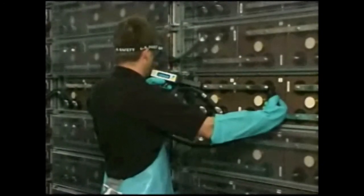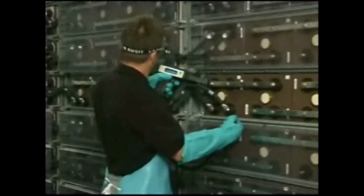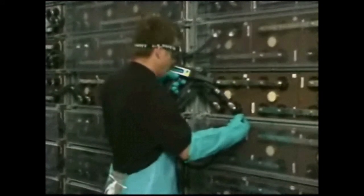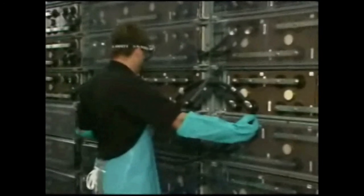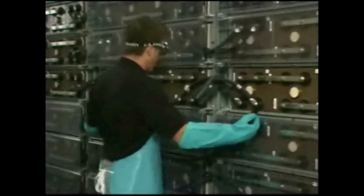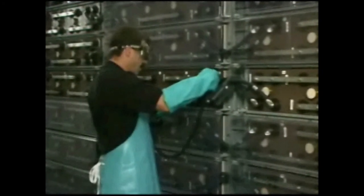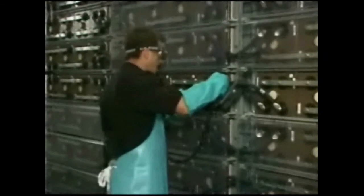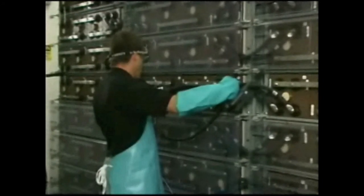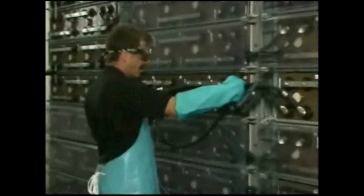Go all the way across here again — diagonally across the cell. Let the reading stabilize and pull the trigger. You're going to see here that the inter-cell connectors are going to be much higher in result because those are cables versus solid inter-cell connectors. You can also see the CT that's measuring the current in the string. And then the last inter-cell connector, because each cell has to be associated with an inter-cell connector. We continue with the rest of the string measuring all the way down through all 24 cells.